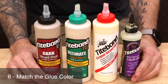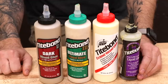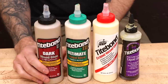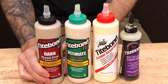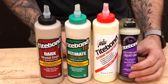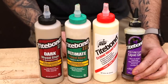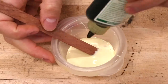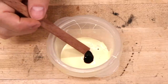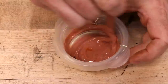If your glue line matches the color of the wood it's a lot harder to see and the panel just looks better. Glue comes in all different varieties — light colors all the way to grayish and straight-up dark. The dark type is great for things like walnut. Other varieties are translucent so you don't really see them because the natural color of the wood shines through — things like hide glue and polyurethane glue. Did you know you can actually dye glue to a particular color? It's water-based, so a little dye gives you a reddish-brown glue perfect for something like mahogany.